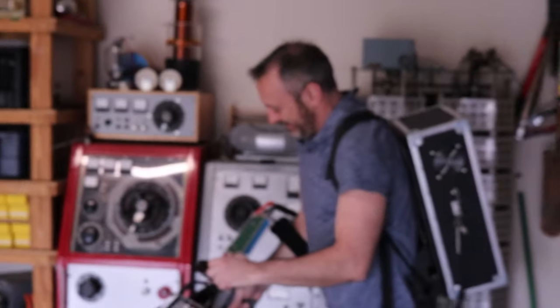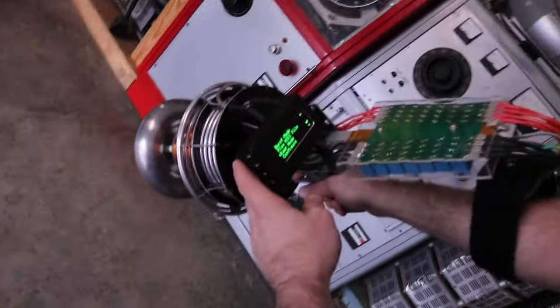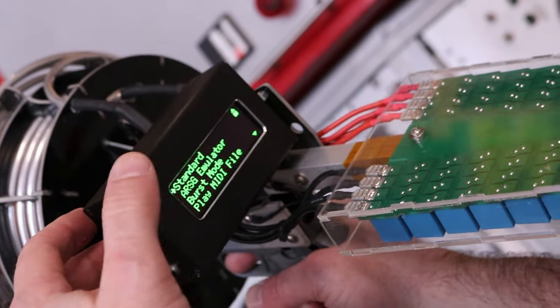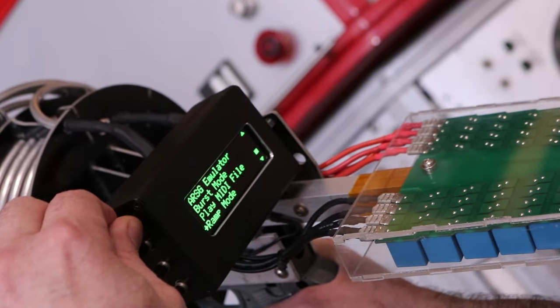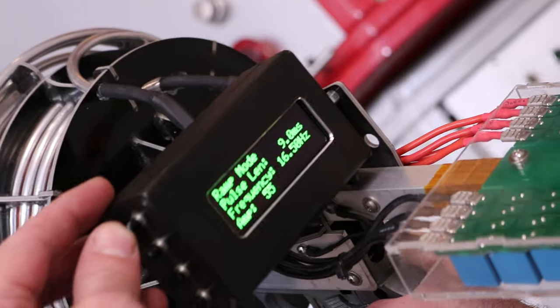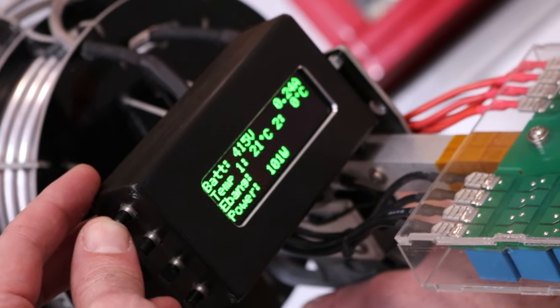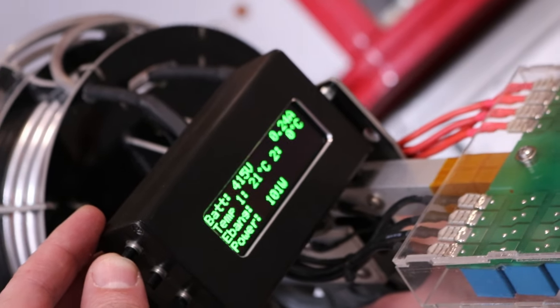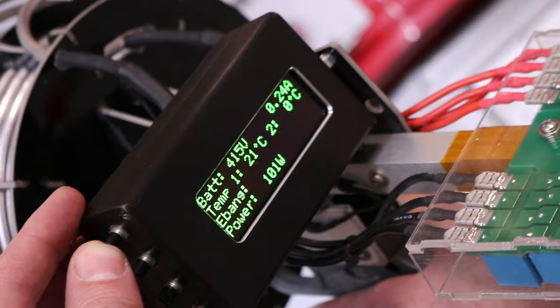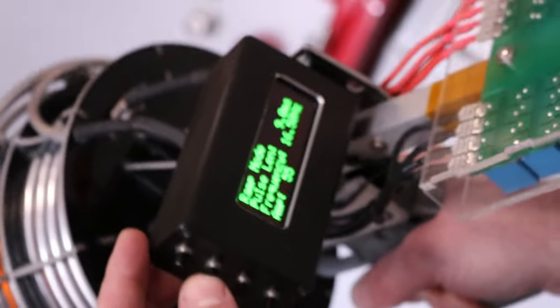Let's go shoot it. We're going to get into ramp mode—let's check out the controller real quick. So there's ramp mode. If we went to standard mode it wouldn't work because this expects the trigger function, which is only on ramp. We can adjust pulse length, frequency, and current output. Battery voltage is 415 volts, 0.24 amps, power 101 watts.